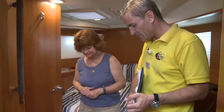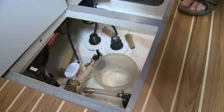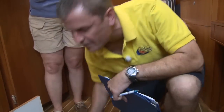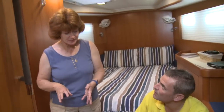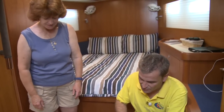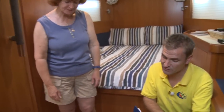While we're here, I can see the floorboards are up and there are quite a few hull openings or seacocks here. What we're looking for is some method of blocking those holes. It's great to see you have bungs attached here. One thing we sometimes see is that the bung is too big for the hole — people look at the size of the pipe but the hole in the seacock is often smaller. We also have a bag of different sizes of loose bungs and a collision mat accessible, so if the attached one isn't the right size, we have alternatives. Just having a bag of bungs of all sizes is a great idea. And it's good to see you've got a collision mat as well.